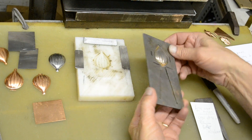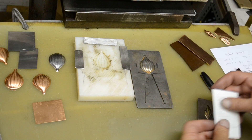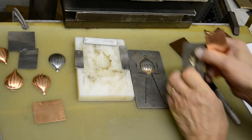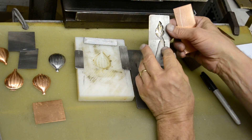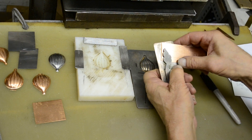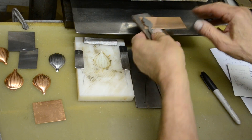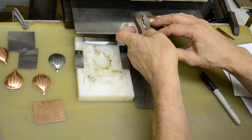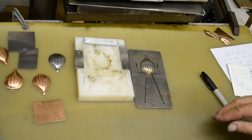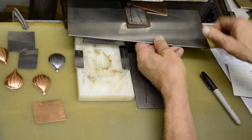This has actually turned into a sort of hybrid process where I have already for quite a while been making and using these dies that are a one-step cut-and-form die with low profile designs like shots or wires, where you cut the metal and form it all in one pressing. That's pressing into a hard urethane pad.